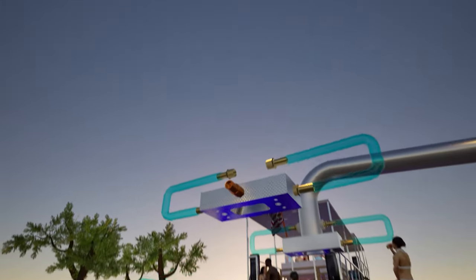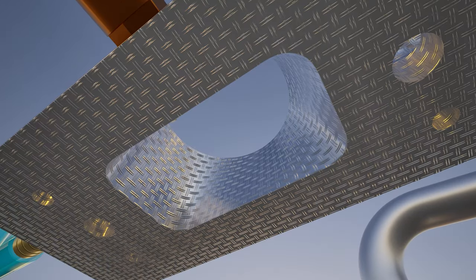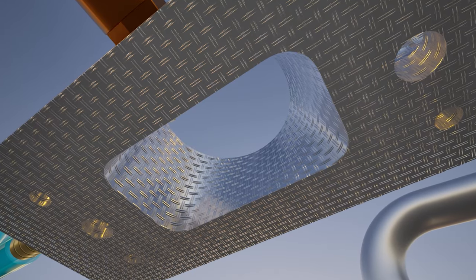We made it through the first couple operations there, which was cleaning up the outside of that aluminum stock, and then we drilled a couple of the water holes. Now is the biggest feature we're going to have to cut out of this, which is the rectangular exhaust port on the bottom, and it shows it's probably going to take about four hours to cut that out.